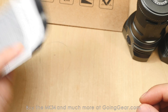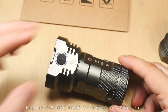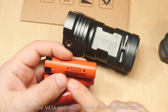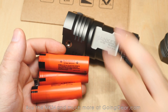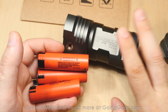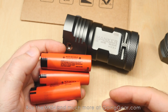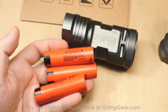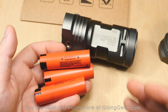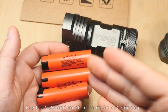The batteries on this: it takes three 18650 batteries — specifically three high-drain, unprotected 18650s. That basically means you need IMR batteries. The only ones we currently sell that will fit and power this light are the Sanyo NCR 18650 GAs. We have a bundle available on the site. This battery tube is super short, so you can't fit batteries with thick wrappers, protection circuits, or large button tops. These are the only ones in stock that fit, but they're really high quality — great capacity, high current delivery.